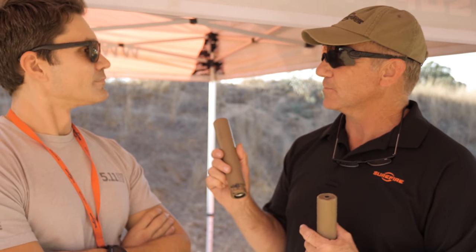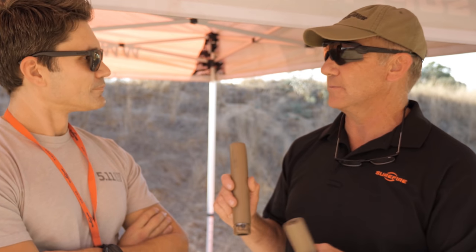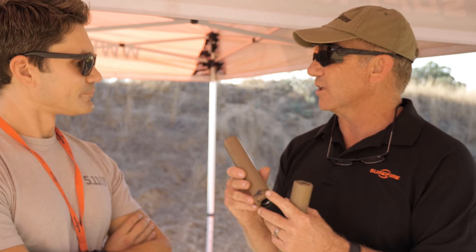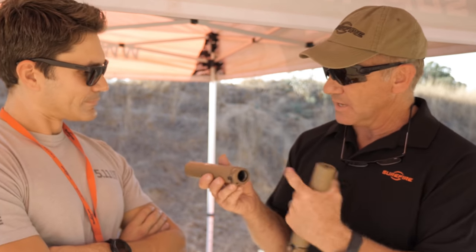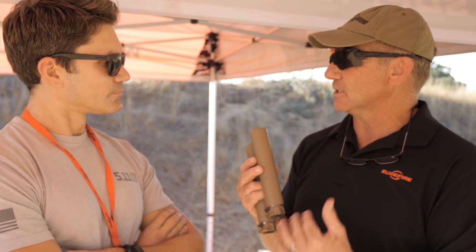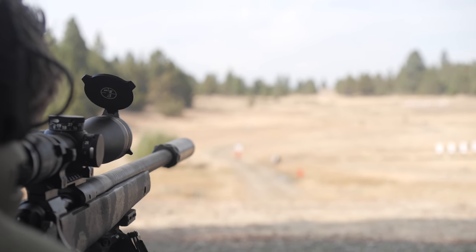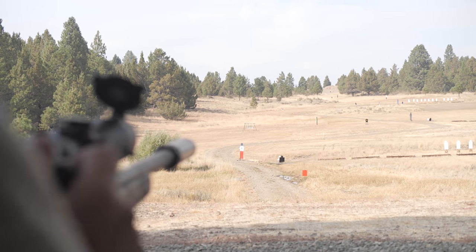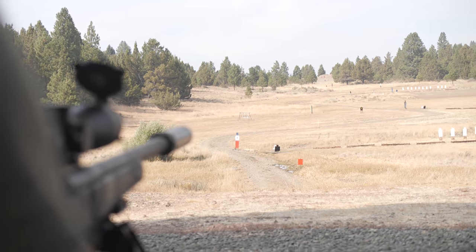The RC2 is optimized for assault rifles — largely Inconel construction. Every baffle, the outer tube, every spacer is Inconel. There's some stainless on the exit baffle and a couple different types of stainless in the attachment, optimized for their respective part of the suppressor. Back pressure wasn't an issue for the Ti — it was designed around bolt actions to get the ultimate sound reduction and the most accuracy in a nice 11-ounce package.